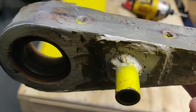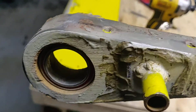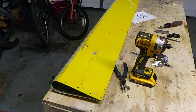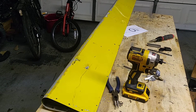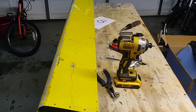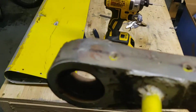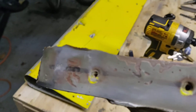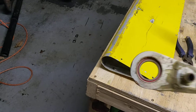If this were to take a flight load, those six screws would be taking all the torque. I really don't like this system. You're supposed to be able to extend these flaps at 100 knots — 105, 110 miles an hour, if I read the specs correctly. Well, even if it's 90 miles an hour — those six tiny wood screws. This is supposed to be a 3M epoxy two-part glue that takes all that torque moment.